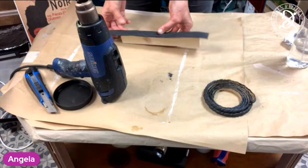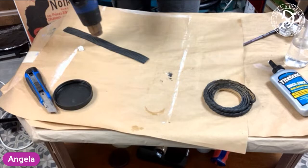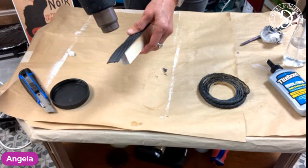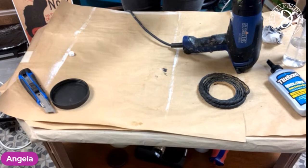I'm actually working with the wood glue from Titebond, which is called Quick and Thick, which is also perfect if you work on vertical surfaces to apply the WoodUbends, and they hold up pretty strong straight away without slipping down, which sometimes can be a pain in the neck.